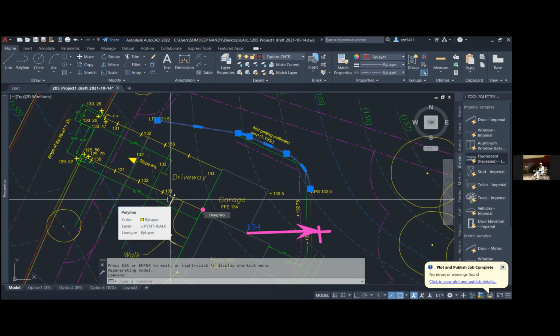That is 134. Yeah. That is 134. Yeah. And this is 15 feet away, 133.75. Okay, yeah. That one is actually 134. Where you calculated 133, but let's do 15 feet away, which is 133.75. Those two, okay. Yeah. And then from this point, calculate this point using 130.26 and 133.75 and interpolate between to find out where the tick marks are.